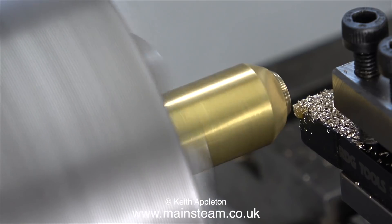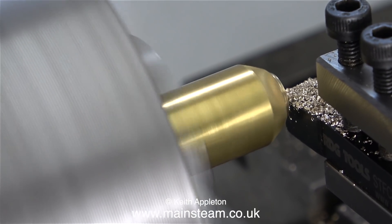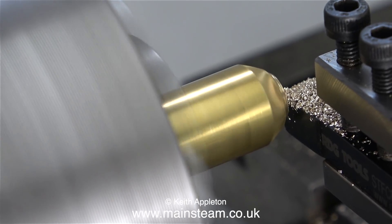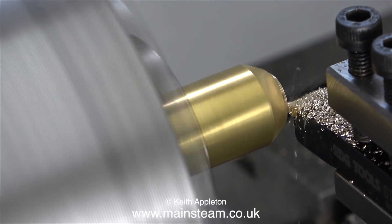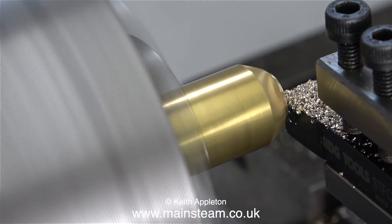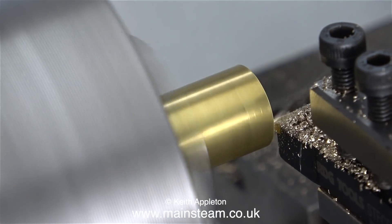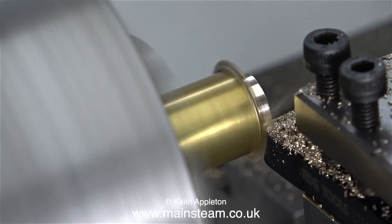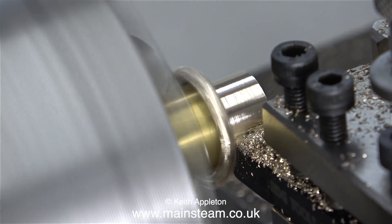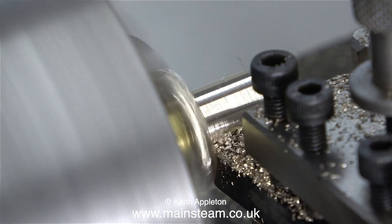When I face across the front, even though the lathe isn't chattering — which really surprises me — when I pull the tool back and relieve the pressure on the work, the spindle and chuck slide forward. In slow motion you can see this very clearly, and when I take another cut the chuck moves back again. This means there's a lot of end float in the spindle. When cutting longitudinally the tool isn't digging in and the lathe performs quite well, which is surprising as the cross slide and compound slide both need adjustment — they are very loose.